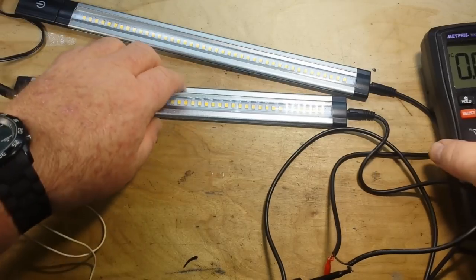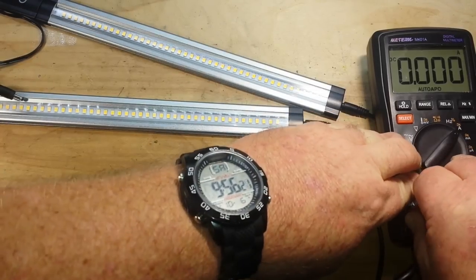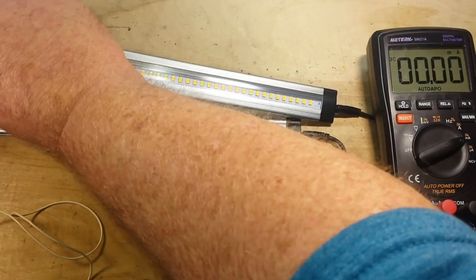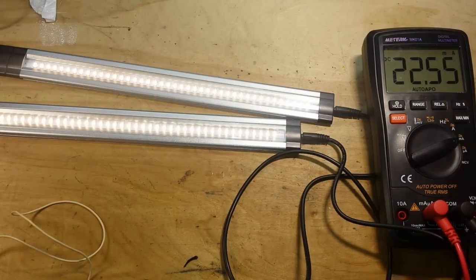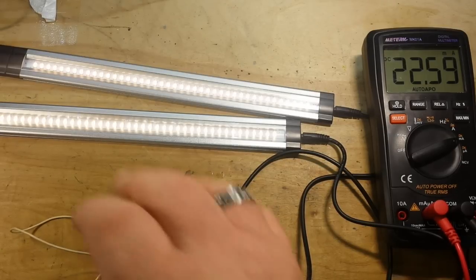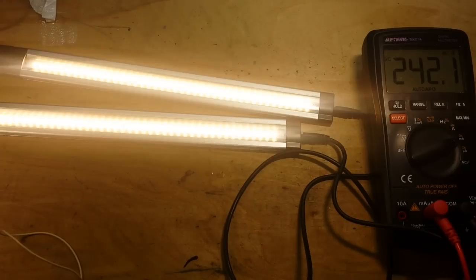Okay, we've got the meter here. Let's go with milliamps and we'll plug her in - hopefully nothing blows up. At our lowest setting we're looking at 25.55 milliamps, so 25 milliamps at 12 volts is about 300 milliwatts. Medium setting: 94.9 milliamps, looking at 1.1 watts. High setting: 242 milliamps, giving us almost 3 watts. Very, very nice.